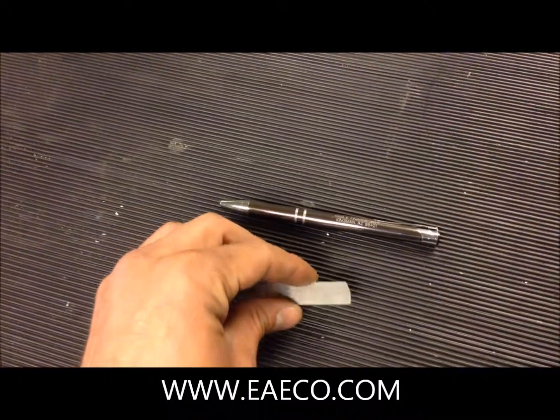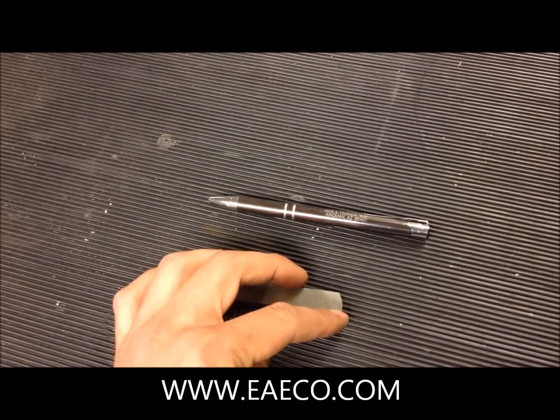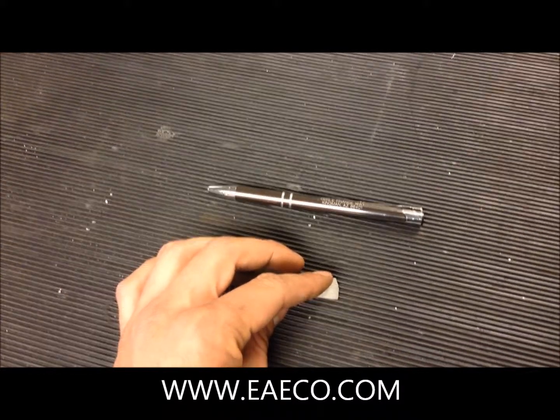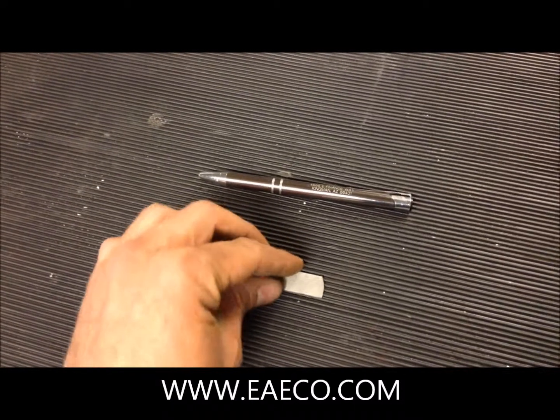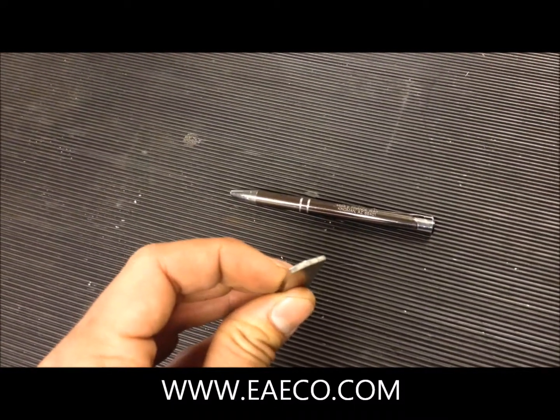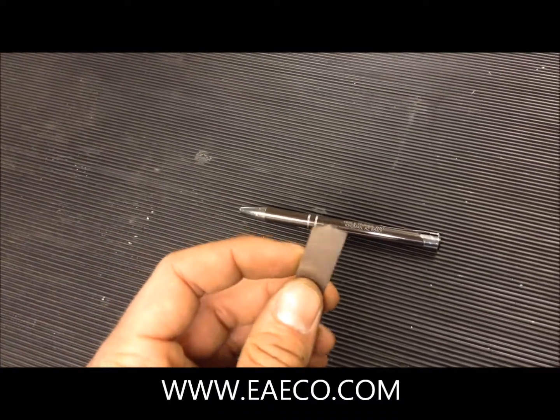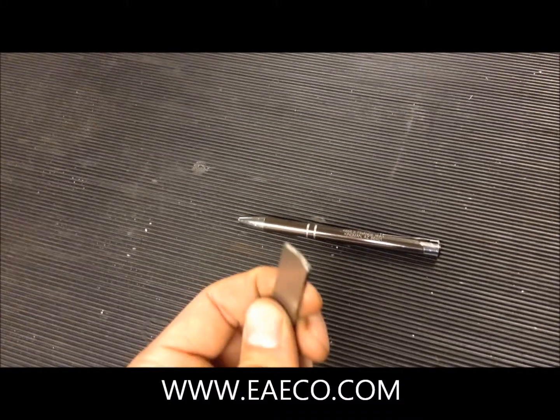What we're going to do is resharpen the blade to have an arced cutting tip like a shark fin. We're going to use a hand grinder to sharpen both sides of the cutting blade, and I'll show you what a brand new one with a brand new edge will look like afterwards.